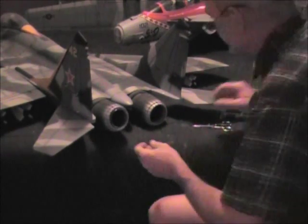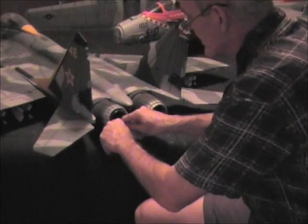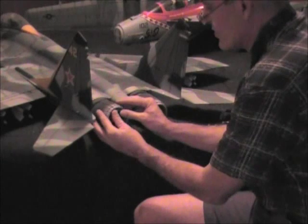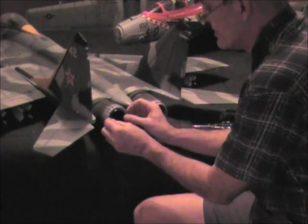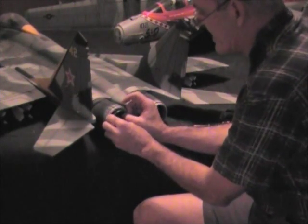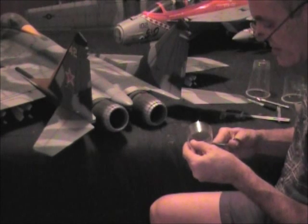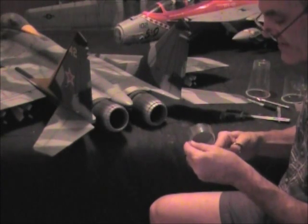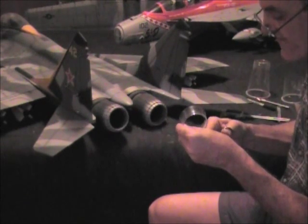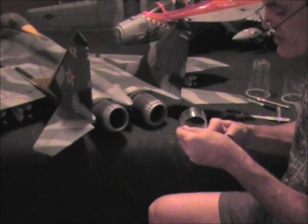I just do it in little small pieces. I put that in there like so, then get it to fit back, just right up to the ball link that's on the inside, or pretty much flush with the exit of the cone. Then you pull it back out gingerly — don't tear up the foam too much. It takes a little patience. If it's a little too big, just shave off evenly a 64th of an inch, just a sliver, and bring it down to size where it fits nice and tight, but not to the point where it wants to crease itself.